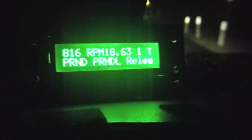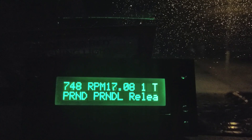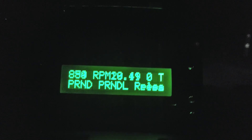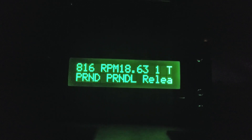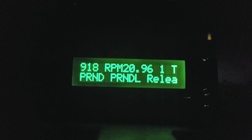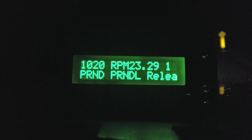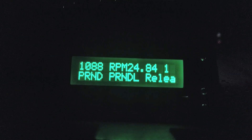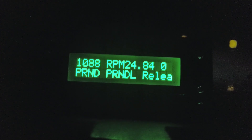Taking it for a little drive. We can see our TPS on the right, values 1 through 7. The brake shows 'released' — hit the brake and it says 'pressed.' On the left is transmission RPM, on the right is speed — that's a quick calculation for gear ratio. I'll have to add a small correction since my tires aren't perfectly 35 inches, they're closer to 34. But it reads the gauge almost perfectly. Give it a little more TPS — now we're into 2nd gear.